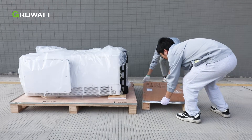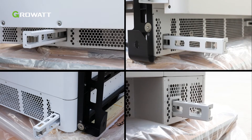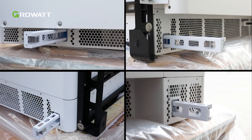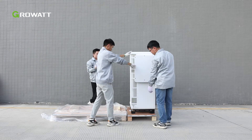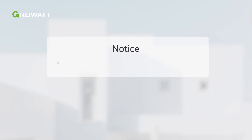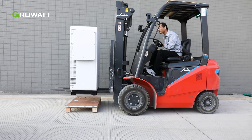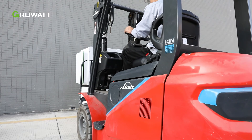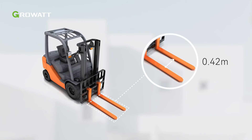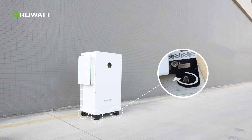Place the bottom support plate next to the bottom of the inverter. Pull out the telescopic handles at each corner of the inverter, then lift the inverter to an upright position and place it on the bottom support plate. Note: it requires 4 people to lift the inverter. Operate the forklift to insert the tines into the pallet openings to lift and transport the inverter to the installation position. The fork width should be less than 0.42 meters. Place the inverter in the right position and then tighten the screws.